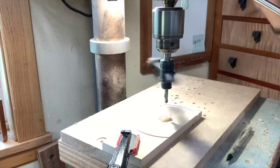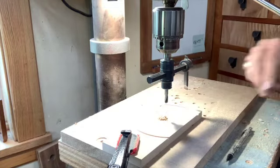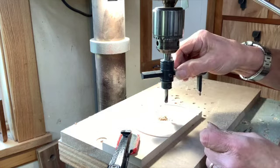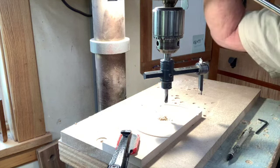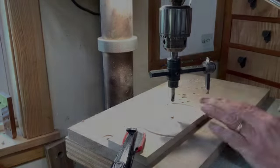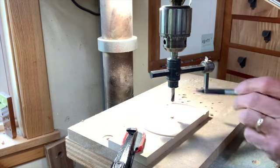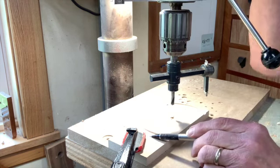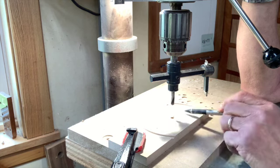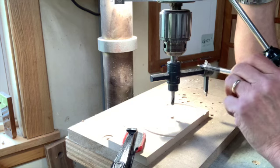That's all there is to that first cut. Now I'm going to loosen the beam and move it out. I've set up my next dimension: in my case, two and five hundred and sixty-eight thousandths of an inch. Quick reminder: once you have this piece clamped down and you have that center, do not move the table, don't move the piece, don't move anything except the beam of your circle cutter. If you lose that center, all bets are off.